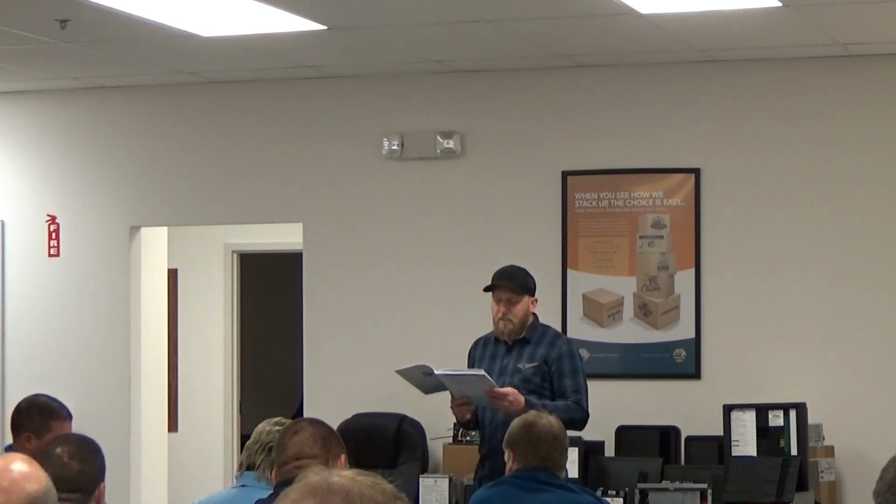Next, we're going into batteries. We've already said we recommend people using lead acid batteries most of the time. AGMs are okay. Gels are okay for the 68100, but not really for anything else. And up for discussion is lithium. Many engineers say that our converters will charge lithium perfectly fine to 90%, and you just won't get that last 10% out of the battery, but it will not hurt the battery. So we recommend anything but gels pretty much, except for the 68100.